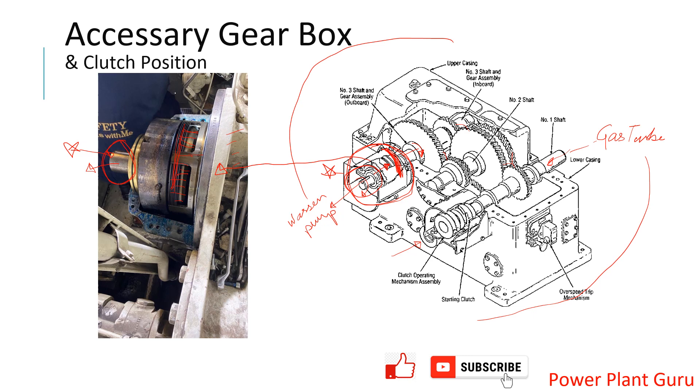To summarize clearly: this is the gearbox where mechanical power is already present with respect to turbine speed. The clutch plates are in a disengaged position when there is no electromagnetic field. When you want to operate on liquid fuel, the signal goes from the turbine control system to this clutch, electric current flows in the winding, creating a magnetic field, and with that force the clutch plates engage with the rotating side — then this shaft gets power and starts rotating.